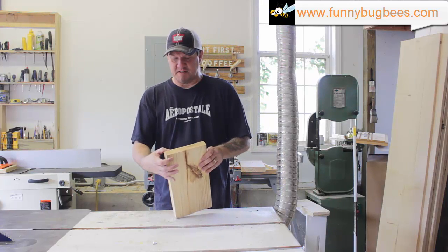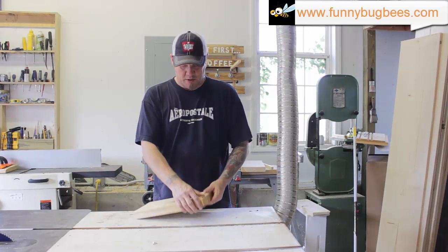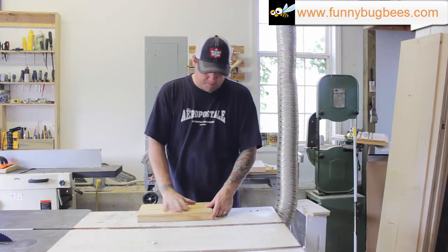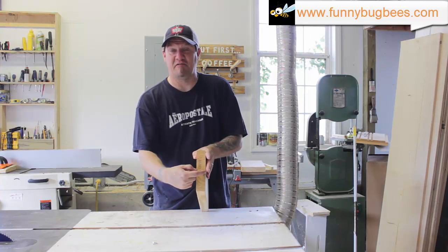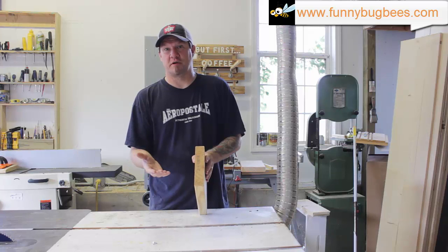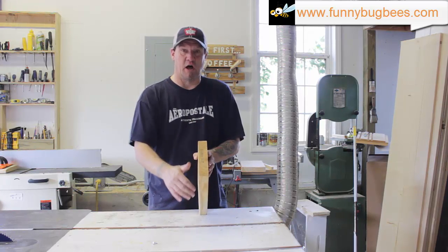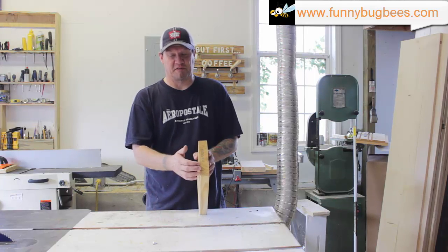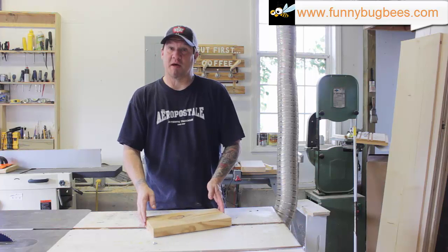The way that we're going to make these are of course 2x6s or 2x8s. They come finished at about 1.5 inches. And a frame is 1.375 inches wide. So what we're going to do is take a little off each side, and then we're also going to cut them to length. 6.25 long is what we need them to be. So let's go ahead and get those cuts done.